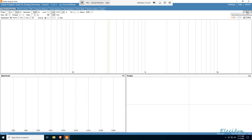If we look at this area as our 20 hertz, 19.9 hertz up there, and here will be the dB difference against the reference voltage, and in the dB of power there. So if we look at the 20 hertz there, we are 0.00 dBr. That's at 20 hertz.